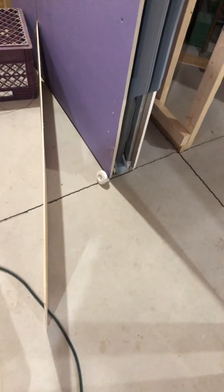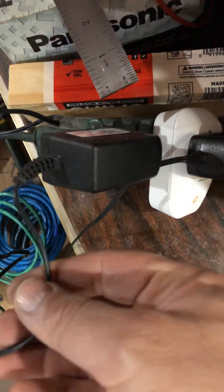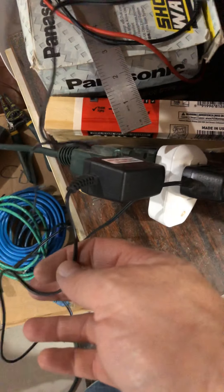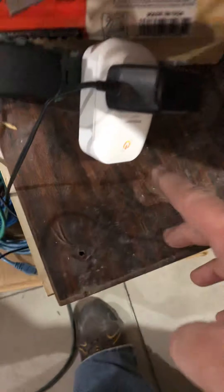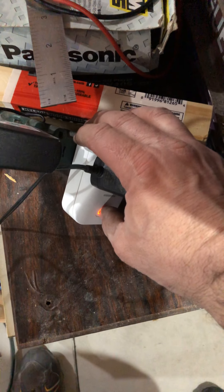Right now I have it connected to SmartThings. I have the motion sensors here and here picking up, and I'm just using one relay here. So with SmartThings, I have the 12-volt power here — 12-volt power on this guy — and that's feeding the power to go to the solenoid valves through the relay, and this is just giving 5 volts to power up my relay on and off. So when it senses motion, this guy kicks on. Now I'll turn it off and it'll switch my relay and shut the doors.